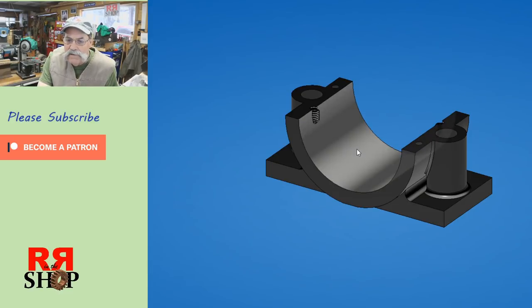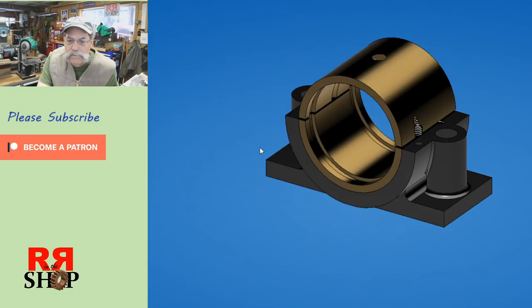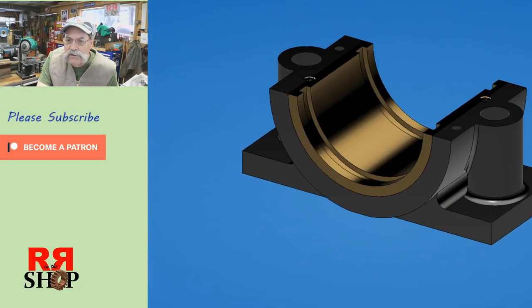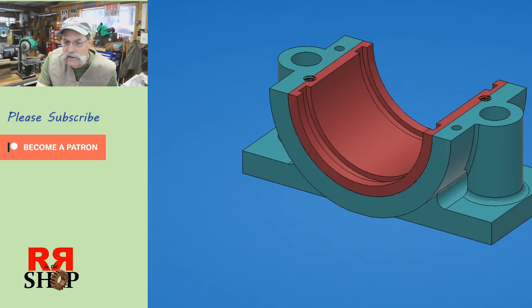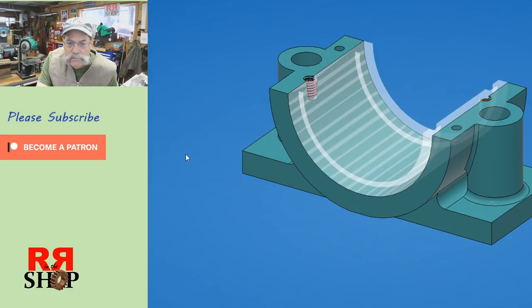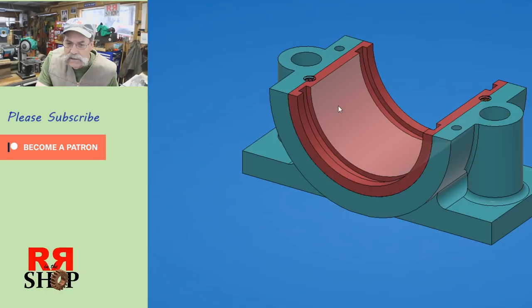So this is the bottom half. We'll be machining this out, and we'll put in a bearing shell. I'm going to change the colors of this so you can see a little bit better. So there's the bearing shell right in there. After we machine the bearing blocks themselves, then we'll be making some shells. We'll make this as a round piece, and then we'll use a slitting saw and cut it in half.